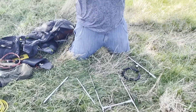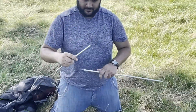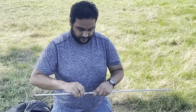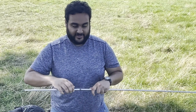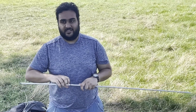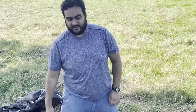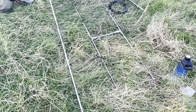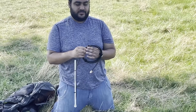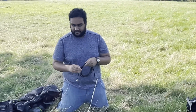Next thing to do is screw the mast together — very straightforward. This antenna isn't going to win you any contests, but it has been very useful for SOTA and POTA activations and just a bit of fun. I've been really surprised at how far I can get. The most recent contact I made was into France, about 300 kilometers away, and that was on Monday. It is quite a good antenna and if you have the elevation it will do really well — a lot better than a whip antenna. It's got about 4.2 dBd gain over a dipole.